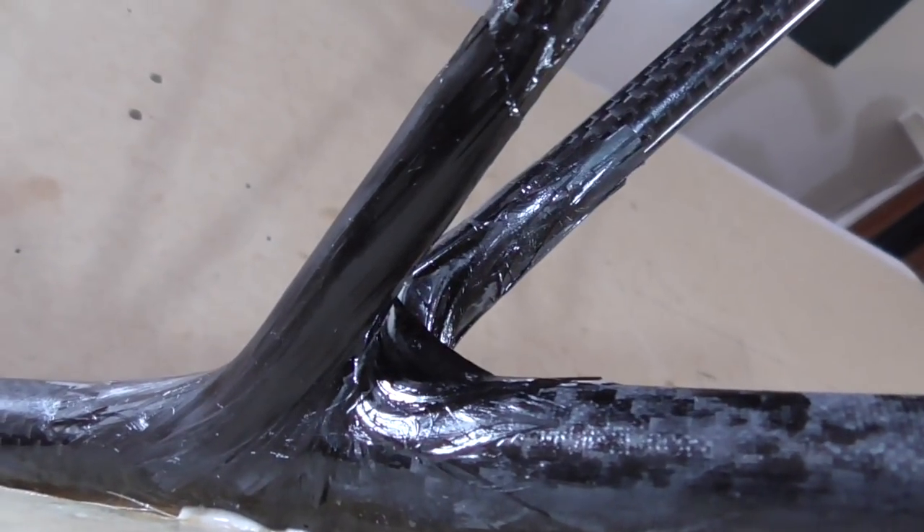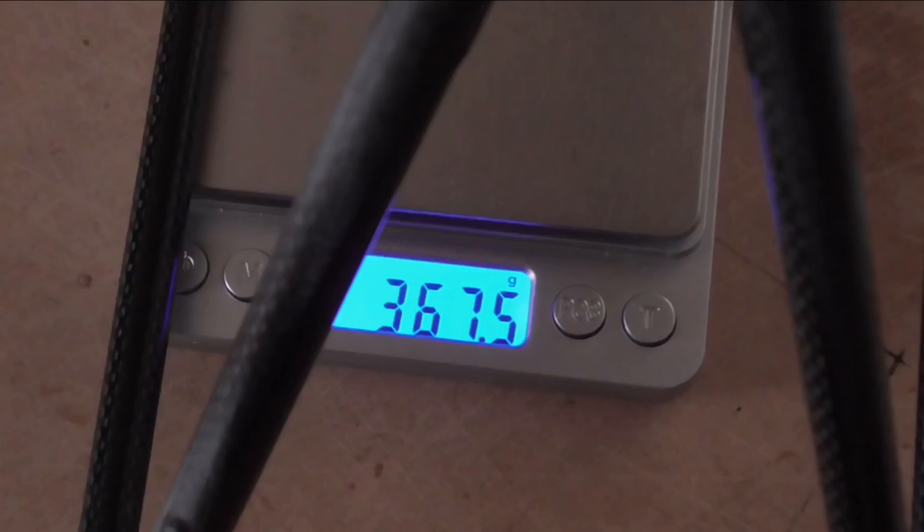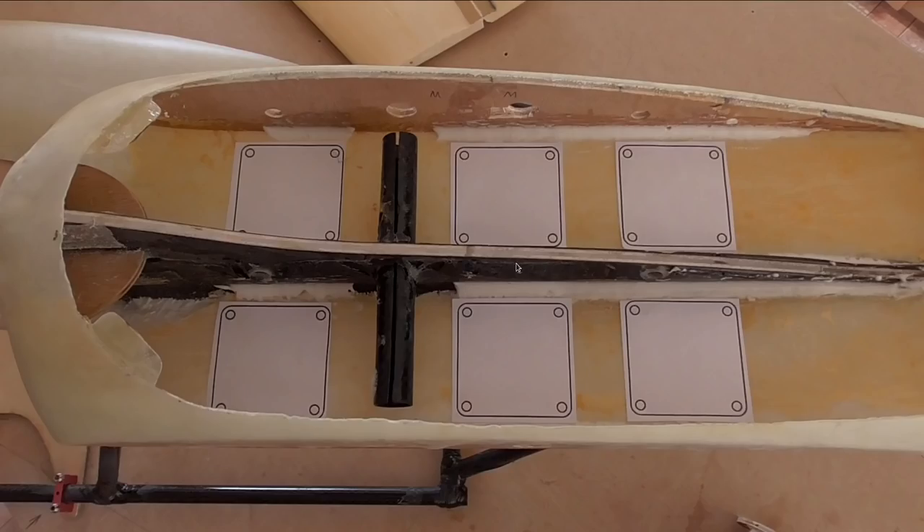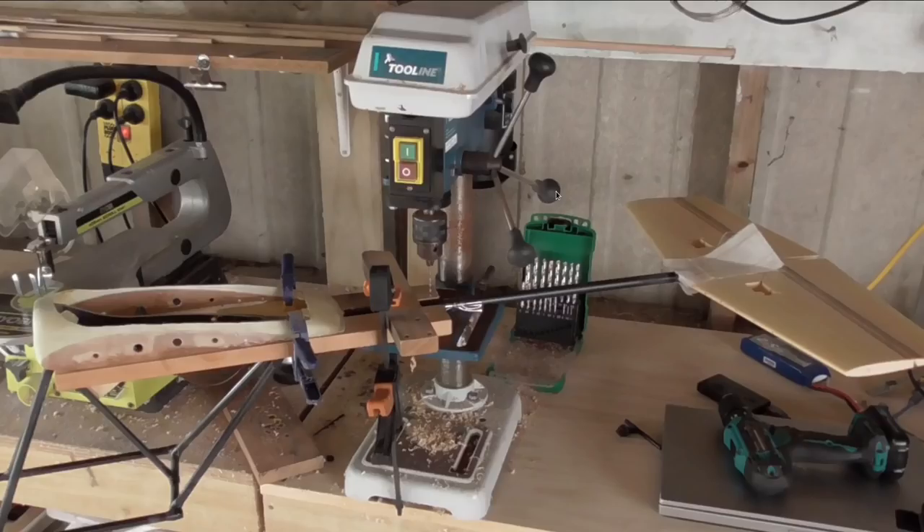This is the overall weight of that piece at that point. I made some holes in the front here for the servo cables to come through - these are for the tail servos and also for the ESC which I'll put underneath the fuselage. So there's going to be two servo cables coming through each of these nostril-looking holes. I also drilled holes for the flight controller positions - I'm actually going to be using one flight controller and one other board which is the same shape and size. More to come on that later if it works.